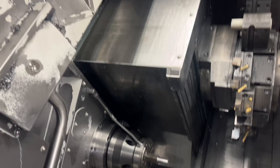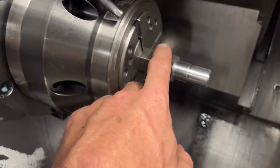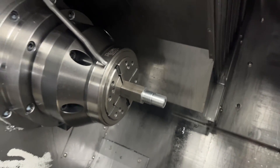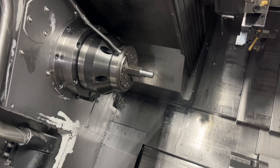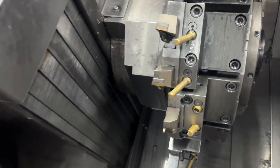So that was our rough turn, finish turn, thread, groove, re-thread. And I turned the OD here with the turning tool. Normally I wouldn't do that, but this thread on the outside is a non-standard thread. Normally I would just use a topping insert that would finish the major, the pitch diameter, and the thread root. But this is a non-standard thread, so I had to go back in and re-turn the major. That's why I did that.